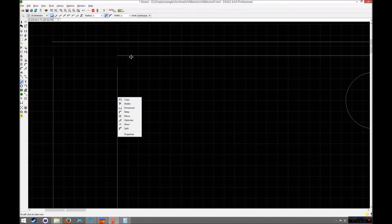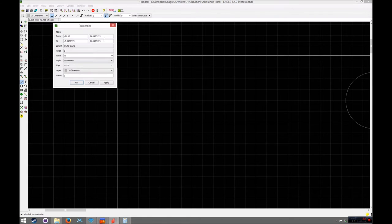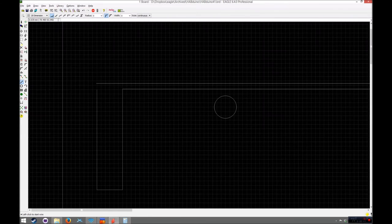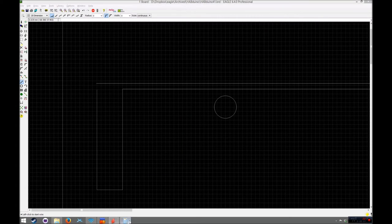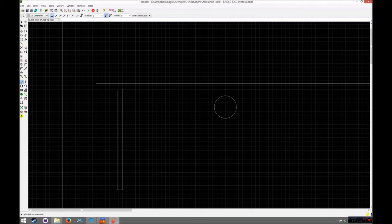Right, so the end of that line there is at -71, so to match up, it's already actually at the point, so all I need to do to get that matched up is put the end point of that in there, and that's now matched up. You've got to be careful, these have got to match up exactly. If they don't match up, it can cause all sorts of problems. Now, as discussed, the milling bit is 0.8 mil, so that's minus 71.12, which is already in there. You need to go back another 0.8 mil. So we'll go there, and we'll put that in there. And that tidies that up and gives us another channel, which is 0.8 mil.